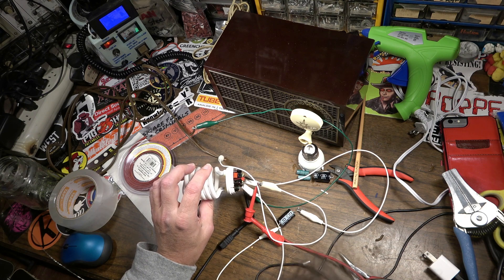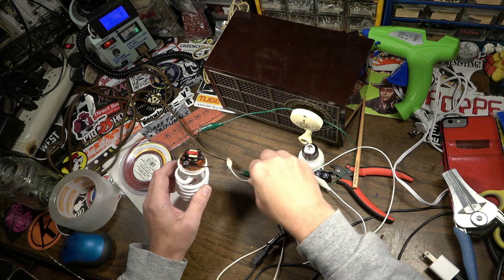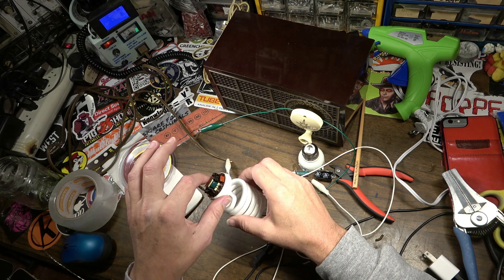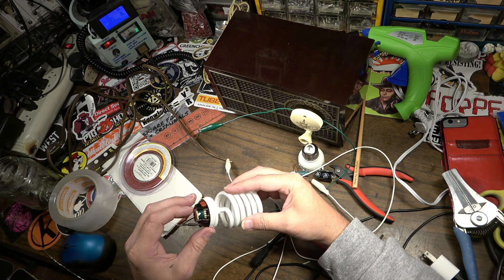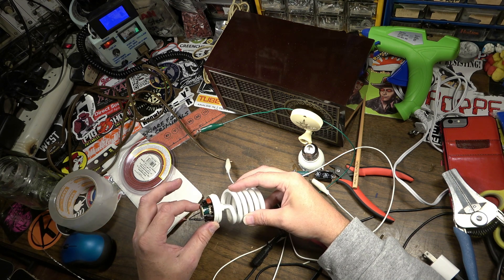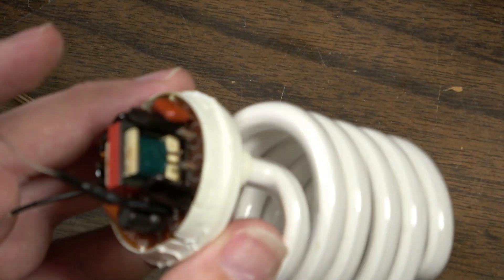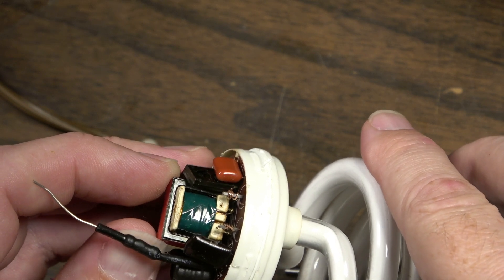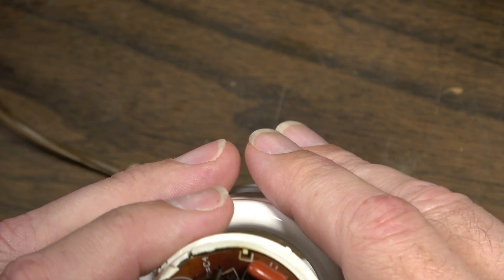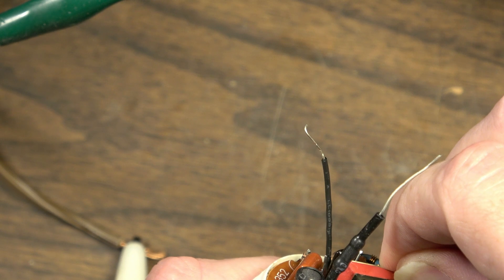It could be because, like I said, there were some connections that had to have the solder reflowed — they definitely needed to be reflowed. But it wouldn't surprise me because of how hot this gets. That's rocking back and forth quite a bit — that little transformer. I would not have expected that to rock like that. See the transformer in this? I don't know if it's a choke. But see how much it's rocking? That tells me there's probably a bad solder joint or something. Something's definitely not right with it — I wouldn't think it would be rocking back and forth like that.